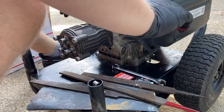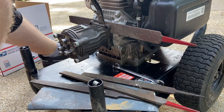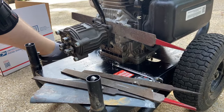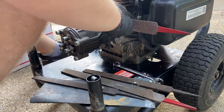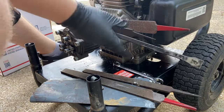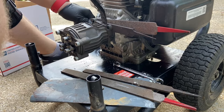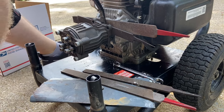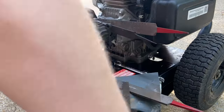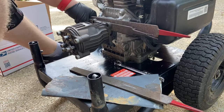Here's how I've done it before — I put this as kind of a nice little backer plate because this is aluminum and it's soft. I don't want to damage it. Just kind of push it a bit. I hear the change in sound — that's because I was hitting the shaft. Then put another one and just keep building it up till it pushes off the shaft. The reason I like files is: one, I have them; two, they go across the whole thing, they're not too thick, they're easy to build up. Just keep adding them and maybe this time the pump will just pop off.